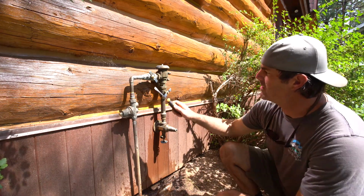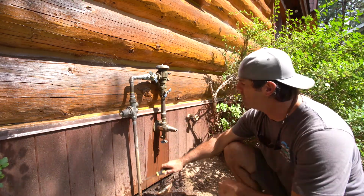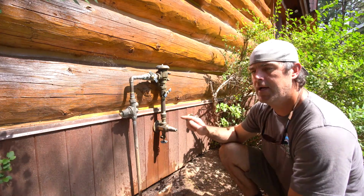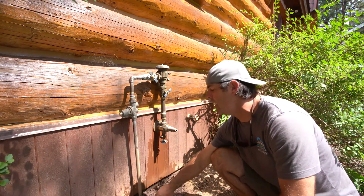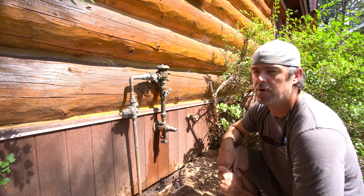So the last piece of this puzzle, we do have water left in this pipe leading to the sprinkler system. So the last thing we would want to do is just go to our controller and manually open a couple of zones so that this water can drain down and be under the ground past that freeze point that we're worried about.